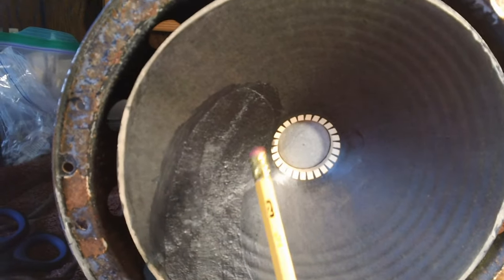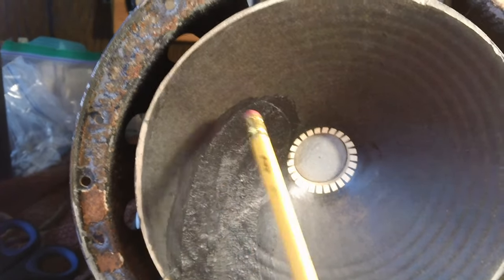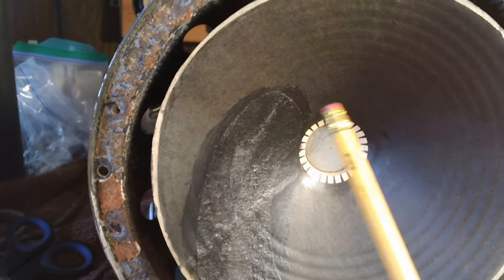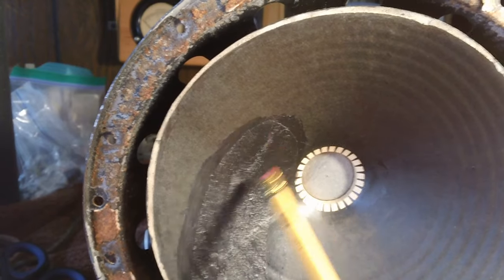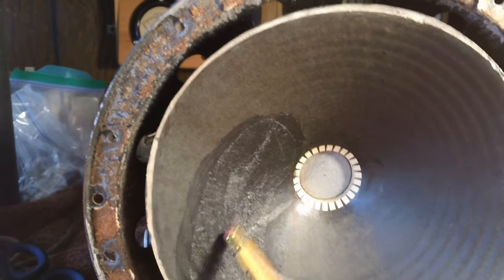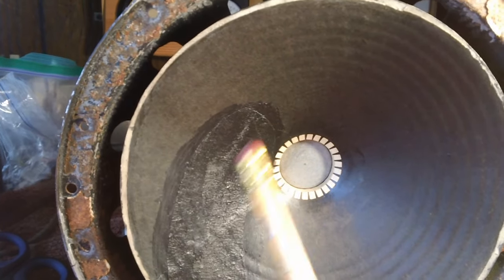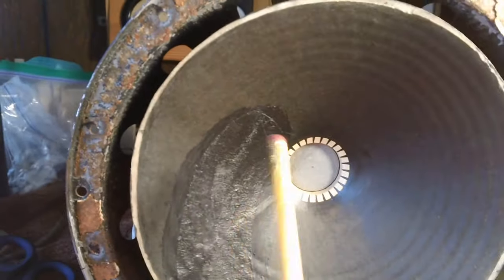Incidentally, here's the patch I put in — it conformed beautifully to the speaker. I put a layer of liquid tape down, drew a pencil line around it, laid the fiberglass on top, then added another layer over the top along the edges. That is nice and solid. This speaker is going to last forever now. I don't even know how that crack got there — it might have been from the last time somebody handled it. It was a big one all the way down, but she's patched now.